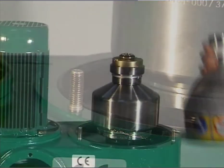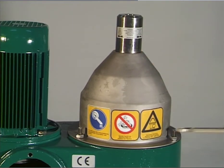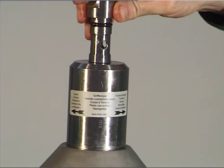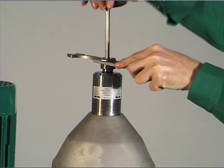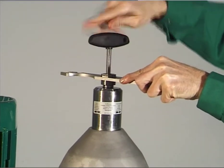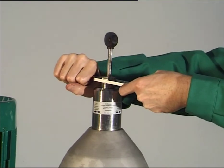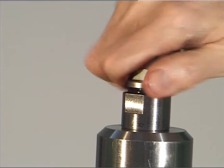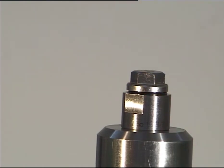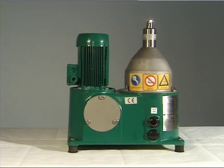Mount the hood. Attention: two studs — the connection threads of the corrugated hoses point towards the rear. Bolt tight the hood with the two hexagon nuts and a hex head screw. Fix the handle connection piece with fitted gaskets into the hood. Tighten the handle connection piece by turning the hook wrench counter-clockwise and holding the T-hexagon wrench. Screw the plug with fitted gasket into the hood, right-hand thread. Before restarting the separator, be sure to refer to the instructions in the chapter before start-up in the instruction manual.